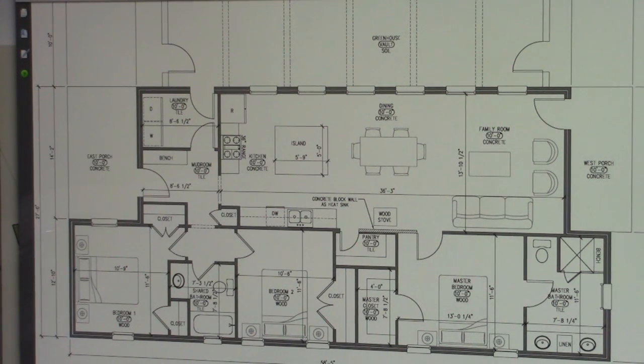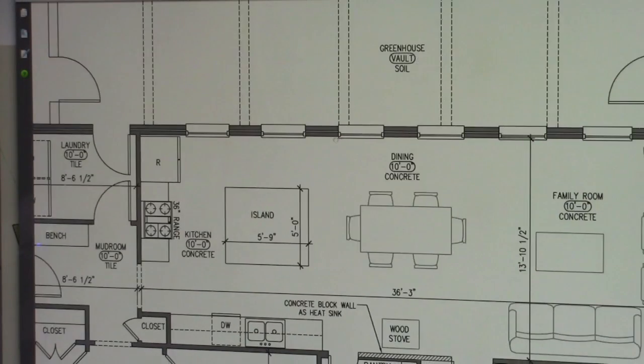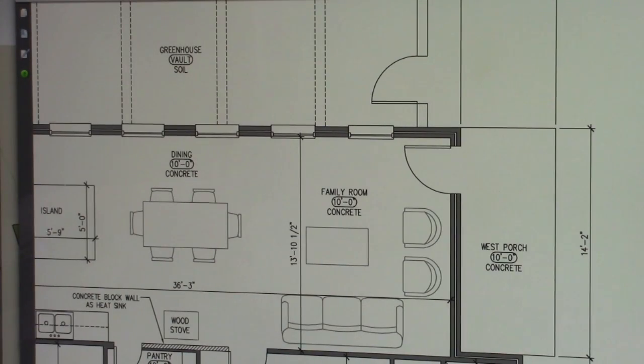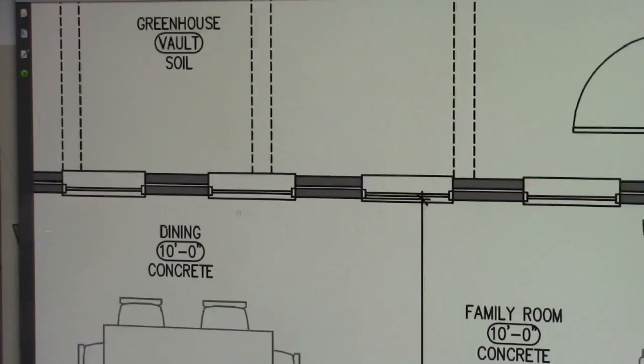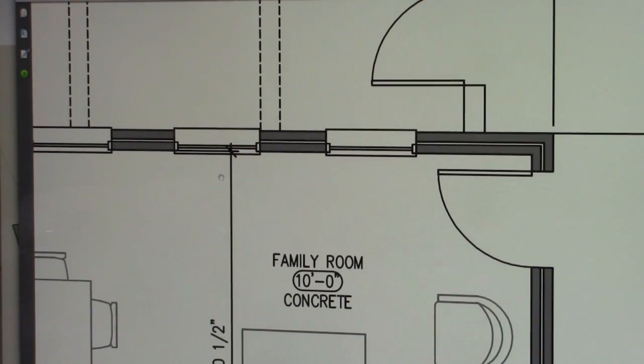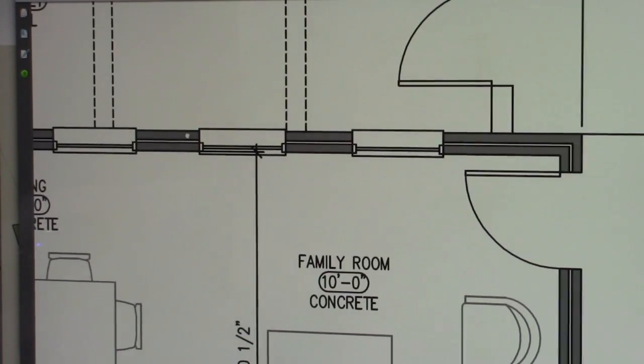We haven't fully committed to the pole barn style of construction, so I just want to mention that we are still weighing costs back and forth between the traditional frame built and the pole barn built style. If we do the pole barn built style, those timbers can be 8 inches or so in depth, some are mostly 6, but some are 8. We'd have to get the engineering done to see what this house would require.